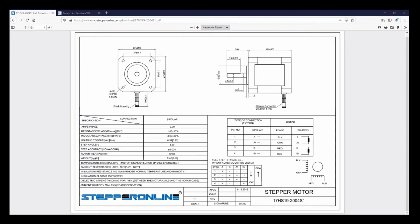And I think you're talking about the echoing that you see on one of these. Obviously you're not seeing it very well, but I had some issues. I was also printing at a higher speed. You might be able to see the imperfections in it. Part of it is due to the slicer. I didn't change to the older slicers to test it. This was with Cura. But Cura's got a bug in it where it turns off your extruder on the last color. So the trick is to go in and edit the G-code and take out the second to last power down of the extruder. Not the last, because if you take out the last one, it won't power down. But the second to last one, when you're doing two colors.